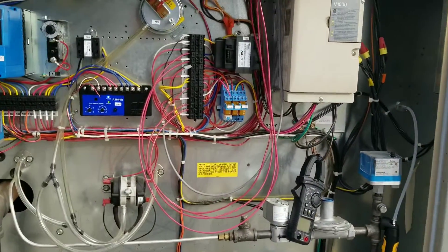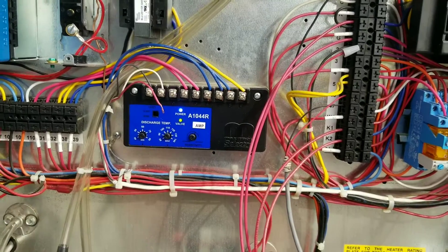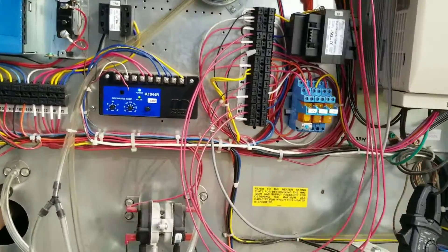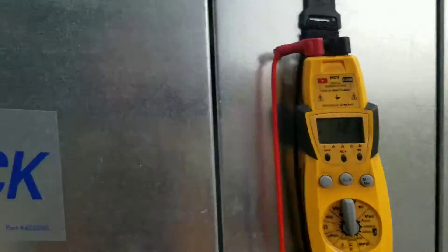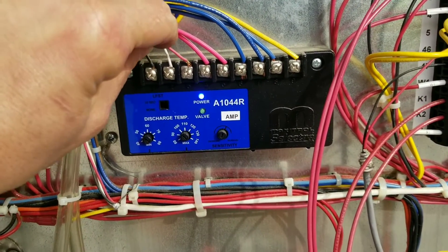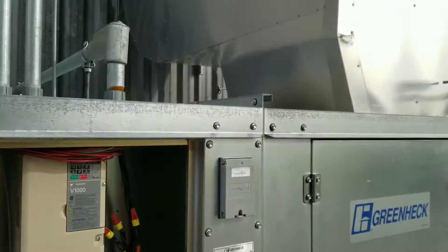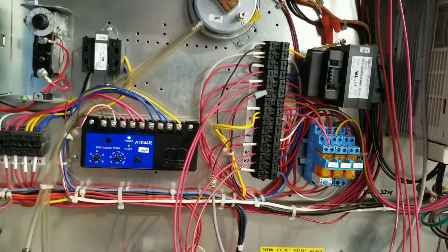The maximum outlet temperature is 140. With everything connected, it's going to try to maintain that 100-degree temperature — low of 50, maximum of 100 is what it will modulate to. Temperature is continuing to rise, about 120. One inch water column seems kind of low to me for this. The setup is a little weird because this is an upflow with a couple 90s restricting some air flow. That was my high fire — taking terminal 8 off puts me into low fire.